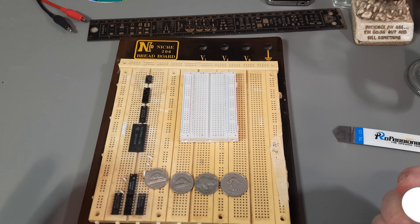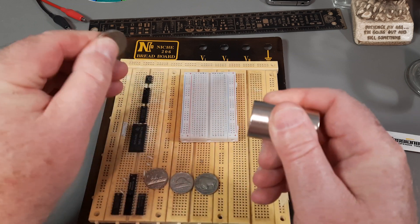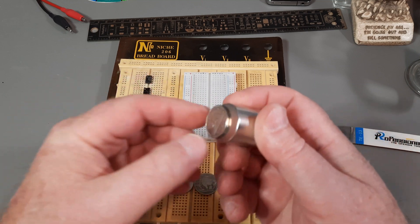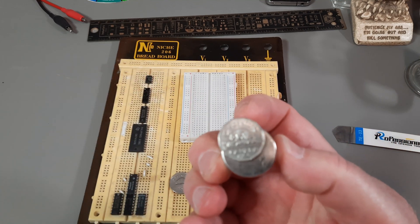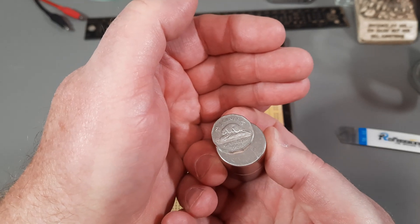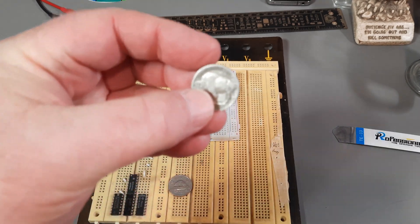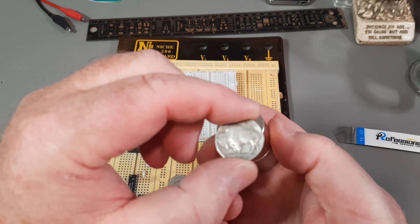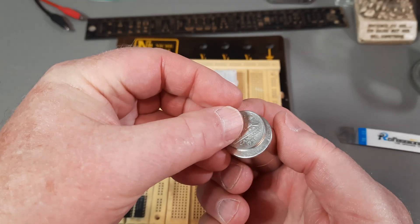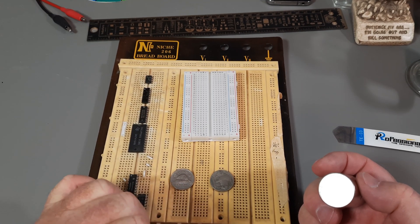Maybe it's pure nickel. Here's a one franc coin — a one franc of that vintage is pure nickel, 99.9%. Here's a Canadian nickel, a 1958, also 99.9% nickel. Here's a US 5-cent buffalo nickel — it's not magnetic, because it, like a Canadian 1998, are 75% copper and 25% nickel.